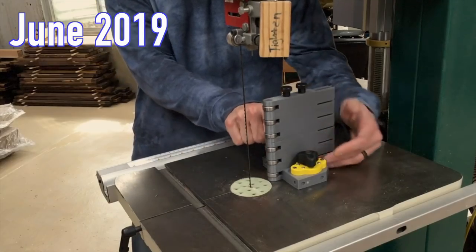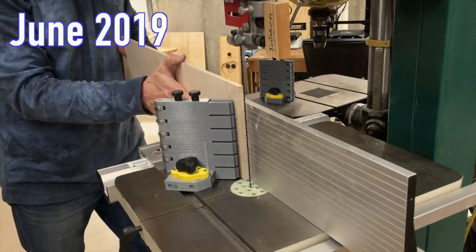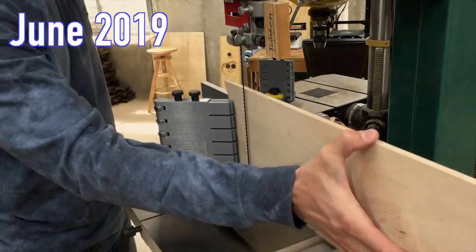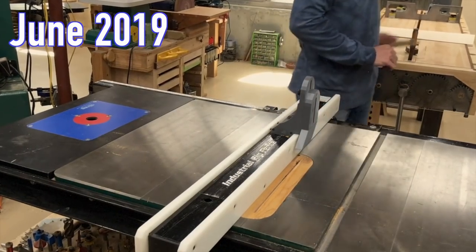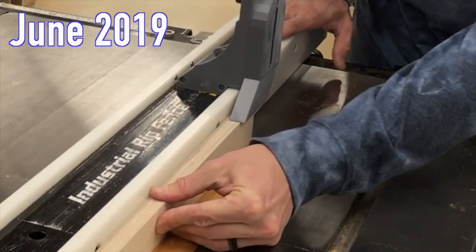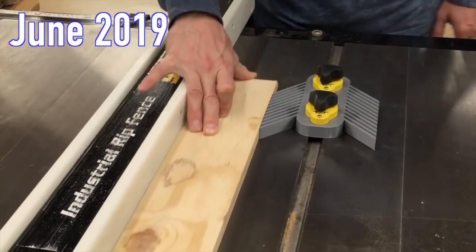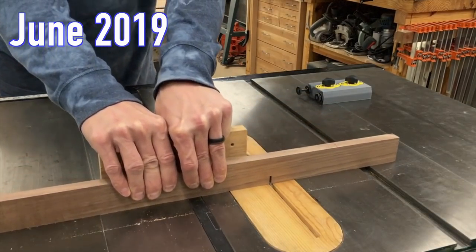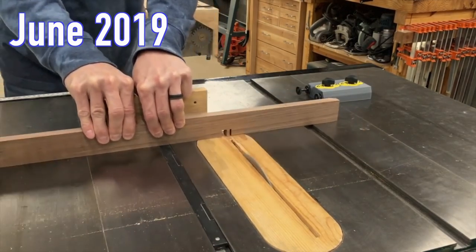And I'm really glad we did, because it's been a lot of fun, and actually a lot of the things in that video that I made we've executed on, like a DIY kit for a roller guide featherboard for a bandsaw, or a downward force vertical featherboard that mounts on the center of a Biesemeyer style fence and gives you stability when the workpiece might tend to lift up, or a universal featherboard that performs well when it's positioned over the miter slot of a table saw, or a stop block with micro-adjustable bump feet that can let you cut repeatable crosscuts on a table saw or repeatable slots.